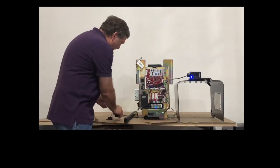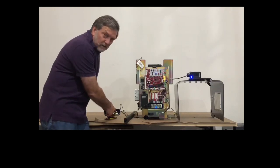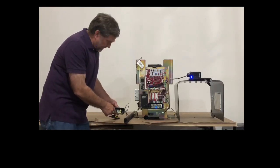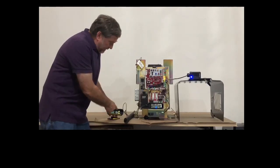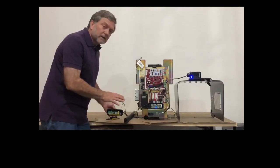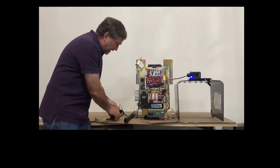But more importantly, we need to make sure that we have our brown and blue wire connected to one of the yellow terminal blocks inside of the wireless transmitter that gets mounted onto the gate. Okay, very important that the switch next to that yellow terminal block is set to open, because this is an open device for when the gate's in the opening cycle. So we set that switch to open.